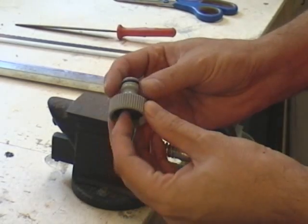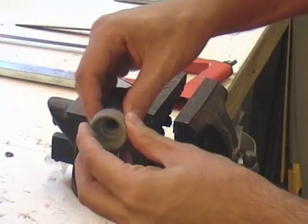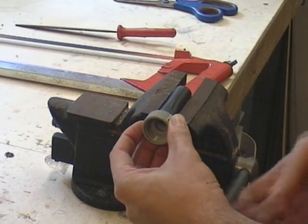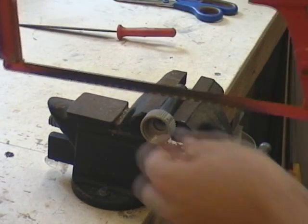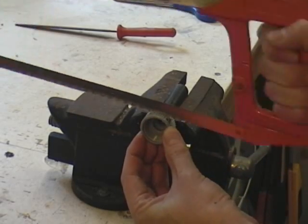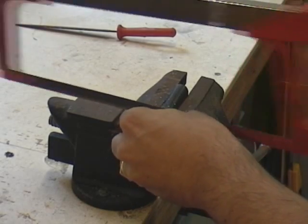The first thing you do is take out the seal that comes with it. What I like to use is just a piece of rubber to hold it in place on the vise, and you grip it. Then you basically cut the thread off with a hacksaw. As you cut, make sure you don't damage the inner edge - just do a pretty rough cut.